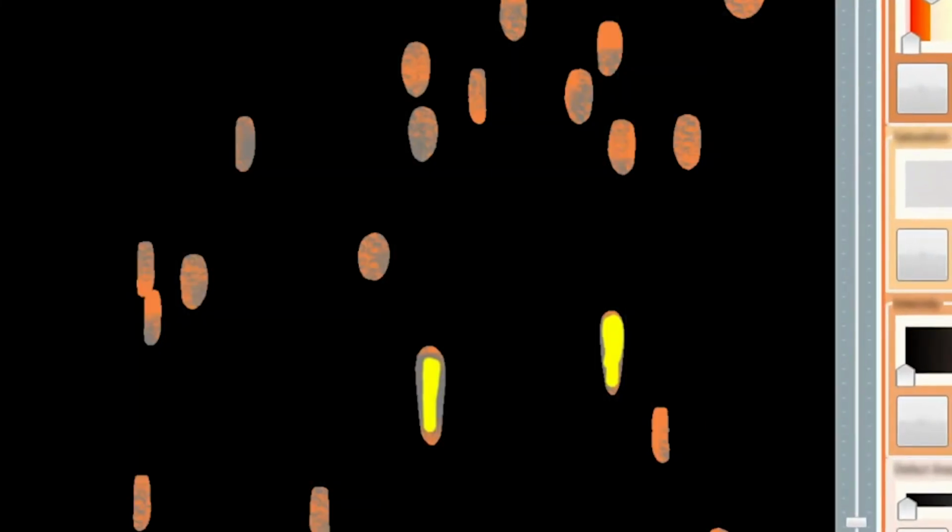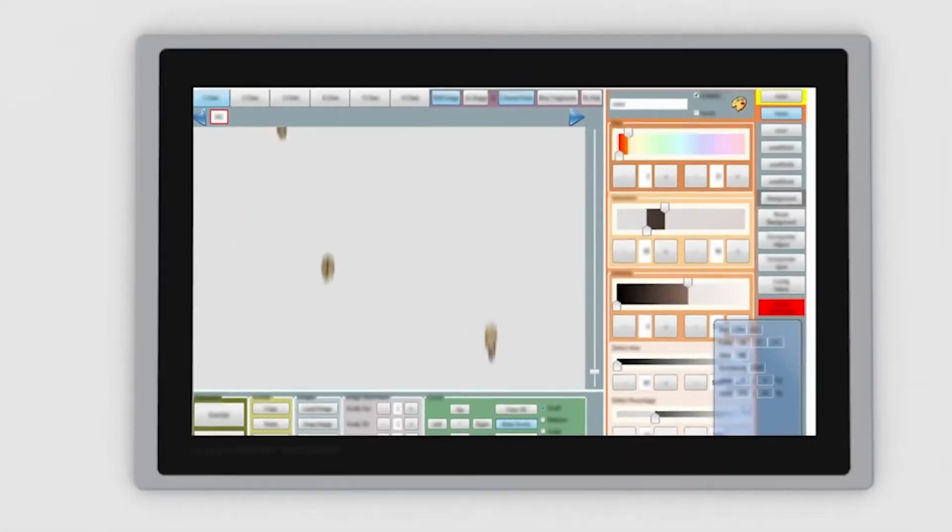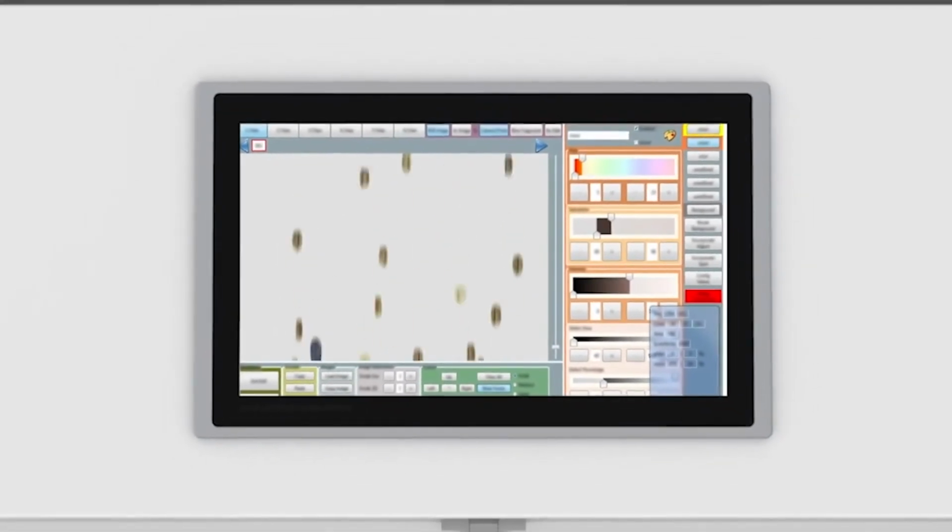That's an automatic machine where every bean passes through a camera. If they do not conform to the color that is in our range, it is rejected. The new generation of this optical sorting nowadays also removes by shape. So this could also be an additional safety in order to have your coffee pretty clean.